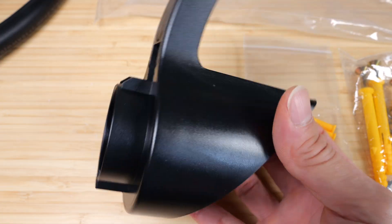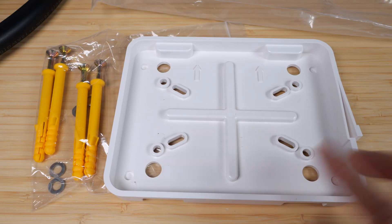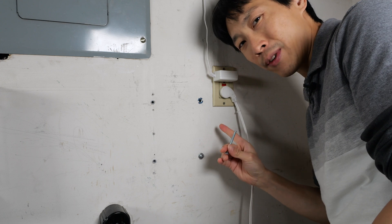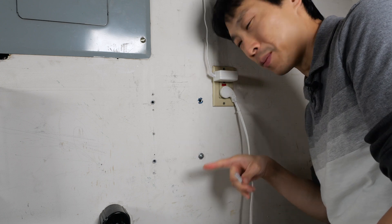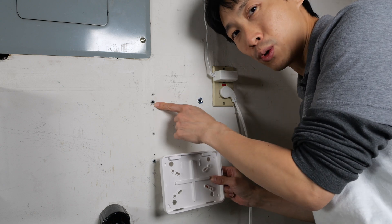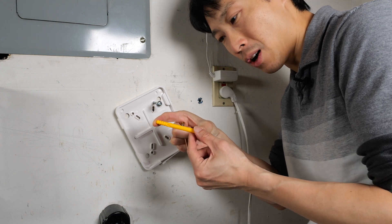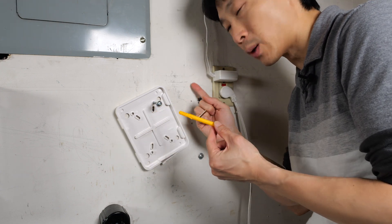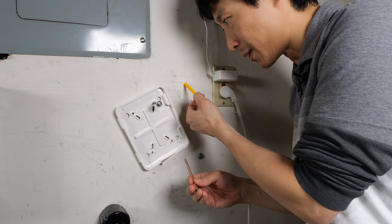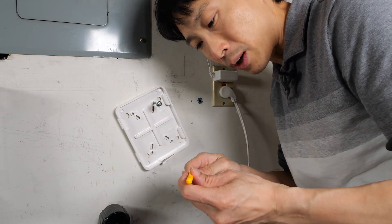The mounting hook is where your cable will sit. You've got these pretty mean-looking mounting screws. For the back plate, it goes up and gives these really long mounting posts and screws. I'm starting to develop a lot of holes over here from different installations of EV chargers. It came with its own screws, but I'm going to reuse one of the holes from a previous installation and mark the rest. The anchor is actually a little bit long — you want it to expand right within the drywall, so it should have been maybe an inch or two shorter. I'm going to have to use my own screws.